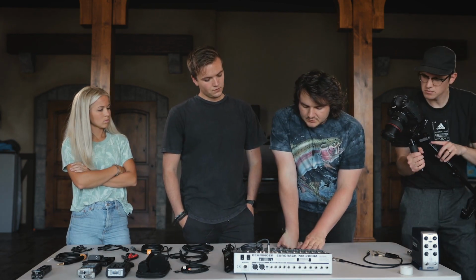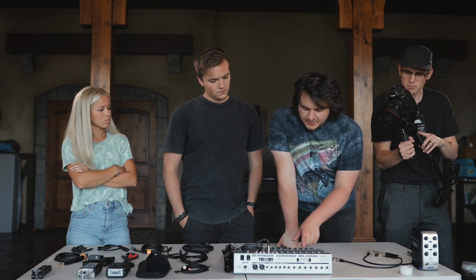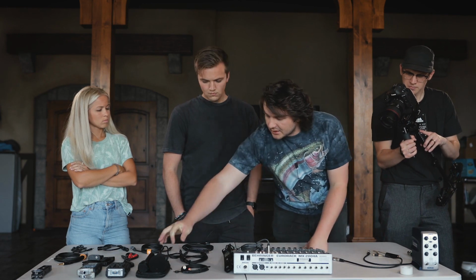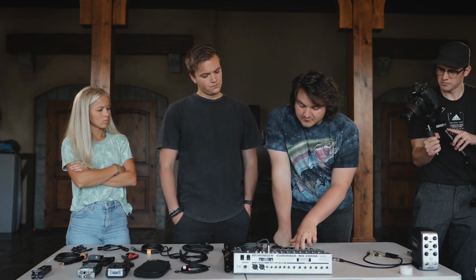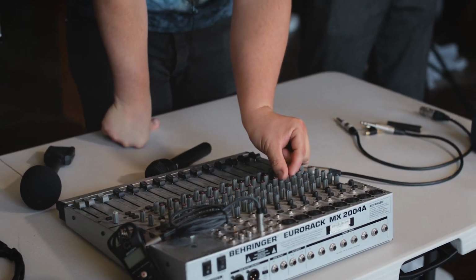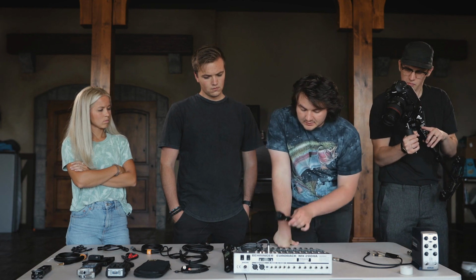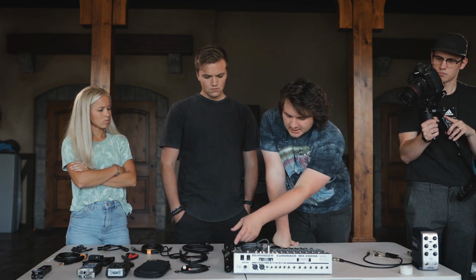So what you want to do, and again, not every board may have this layout and that's okay, but you want to make sure that he sends the dialogue or whatever mics they're going to be using. Say the ceremony is using these 2 mics and they're coming out of channels 3 and 4. Have him send you some feed on the aux send, and then test 1, 2, hello, hello. It'll start recording you hopefully in here.